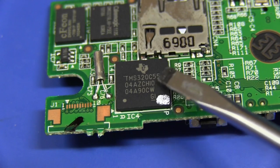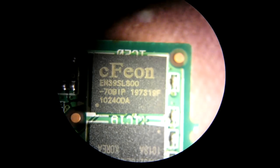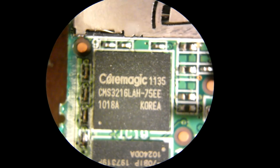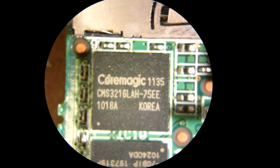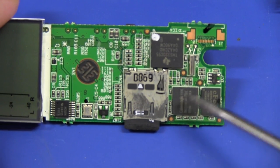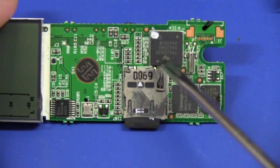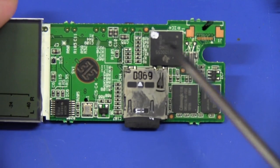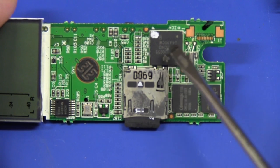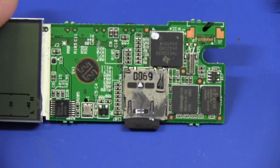The main processor is a DSP - it's the classic Texas Instruments TMS320 series. The first device is an EN39SL800 - that's an 8 megabit flash memory. The other device is a Core Magic CMS3216M - I believe that's actually an SRAM. So we have a Texas Instruments TMS320 DSP processor, external flash, and external SRAM. Interestingly, this is a TMS320C5504, and it already has 256K of built-in SRAM and 128K of ROM - that's not a huge amount of ROM but a lot of SRAM. But maybe they need a lot more. This DSP does support external memory up to 4 megs, so it's most likely the external flash and SRAM connect to the TMS320.